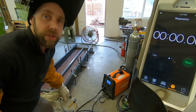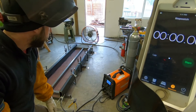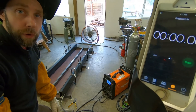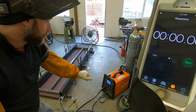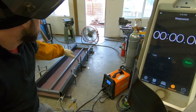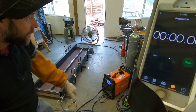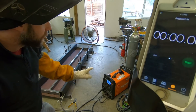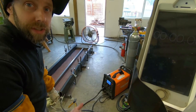I'm gonna be welding this quarter-inch plate to eighth-inch wall tubing here, and I got about roughly 240 inches of weld to put on here. I got the Vulcan Omni Pro set up for quarter-inch metal and we're gonna start welding. I got my timer. We'll weld for about 10 minutes and take a break. I don't think it's gonna overheat but maybe it will, and I do think I might run out of wire — I only got a little smaller spool on there. All right, we'll get welding.